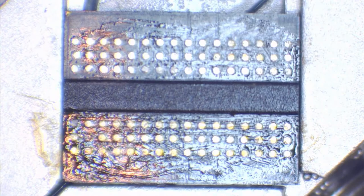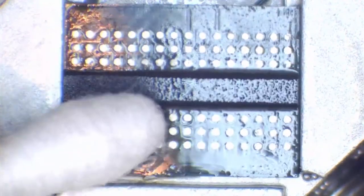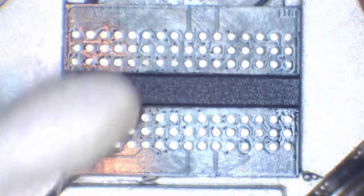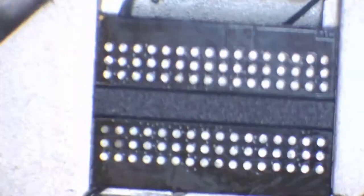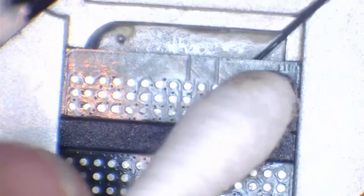So what I'm going to do now is just clean off the chip. I'll get rid of all of this flux that's been left over by the wick, because the wick does have flux already on it, and that's what helps it to absorb the solder. And you're going to see that we've got a couple of oxidized pads, where you can see they're darker. I think they're oxidized, I hope they're not missing, but I think they're just oxidized